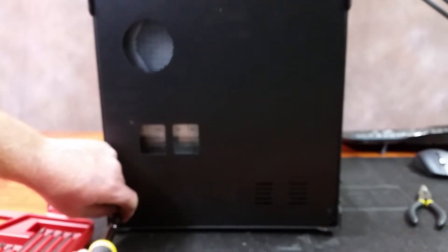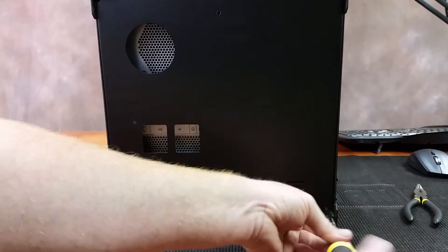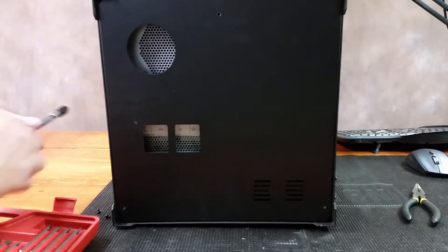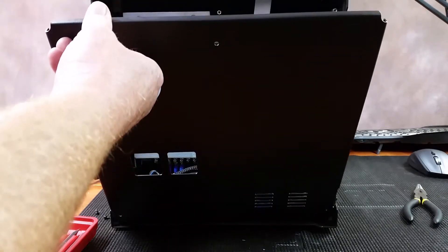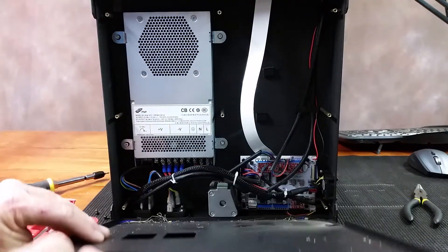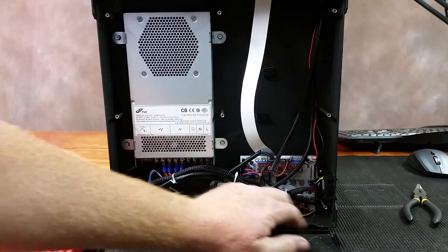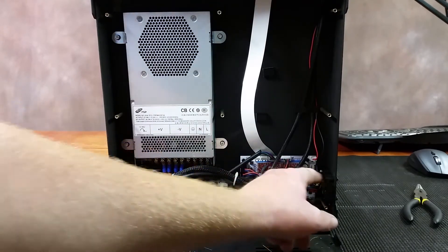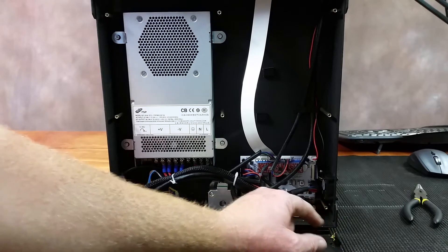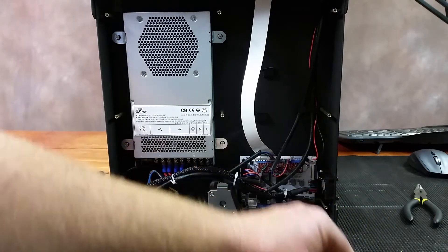Let's get this cover off and just see exactly what we've got to deal with here. I've always wanted to take the bottom of this off anyway, so it gives me a good opportunity to look into it. As you can see, I've got a little bit of filament that got down inside here. So I'll get all that kind of cleaned out. Now there's our board right there. I see some filament got in with the fan — that's probably the reason why the fan's been messing up. Also the nuts have worked off of it as well.